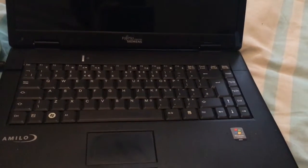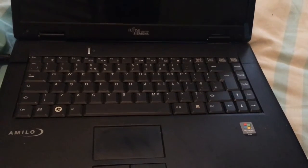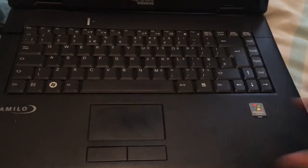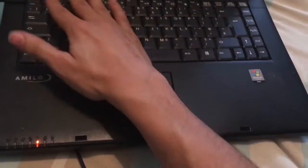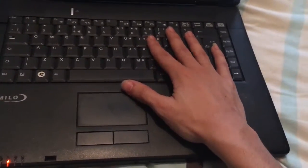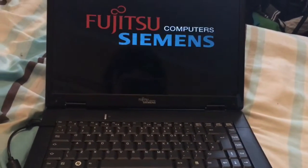And Celerons. Now, I salvaged a HP machine that had the fate of the NVIDIA chips coming off the motherboard. They were desoldering themselves. One of the computers had that fate, and I took that CPU out of there and put it in here, thinking it would work. And at first it didn't.